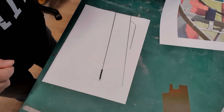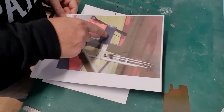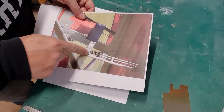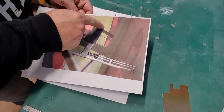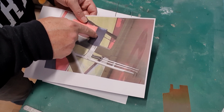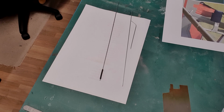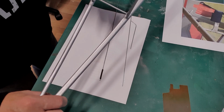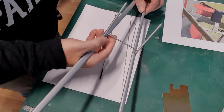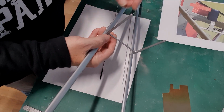So now I'm going to take a look at the pitot tubes. We need to make two tubes coming down through this aluminium bracket, and then the top one is straight with a point on it and a tube, and the bottom one angles down slightly and then forwards and is blunt. Looking at this drawing of this picture and then looking at the strut, if I orientate it the same way, you can see that we need a tube